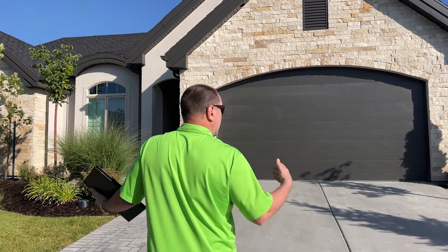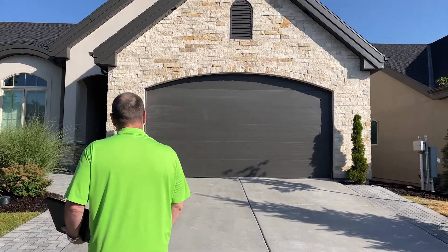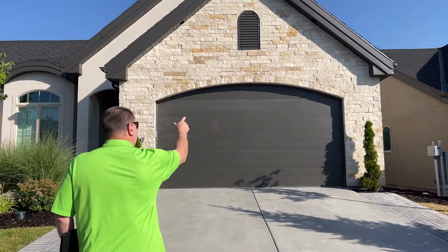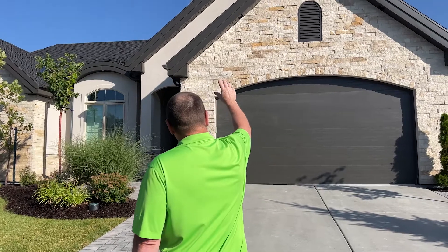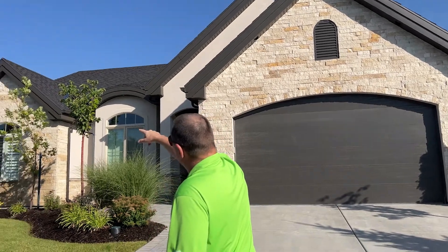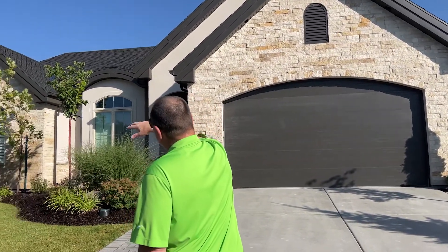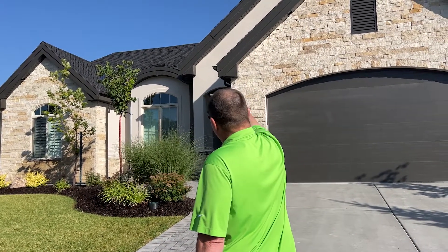The first thing we want to do is find a starting point. I usually start at the front of the home and from my right side. So this over here is the obvious point for me to consider cameras and the coverage they'll provide. I noticed right off the bat there's attic space up here in the garage — you can see the vent — and the tall gables here and over here. There's attic from one side of the house to the other, which is going to make the installation really easy. We're going to be able to wire this entire house right from the attic.